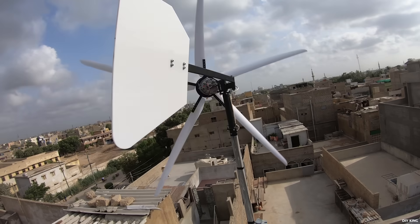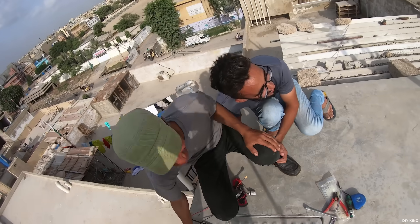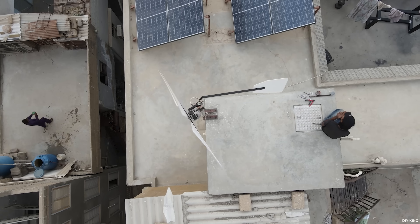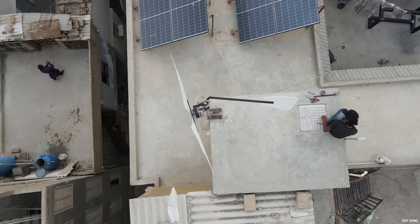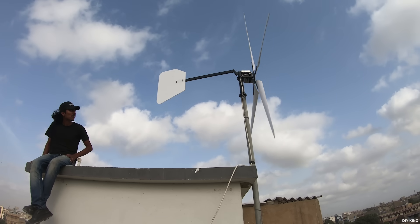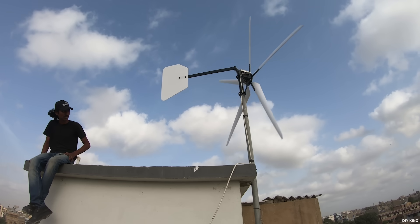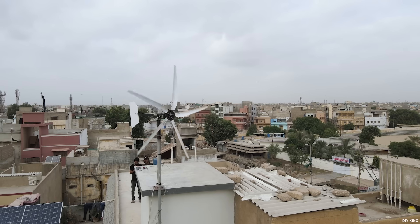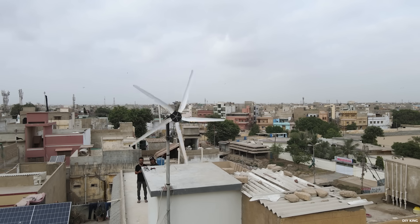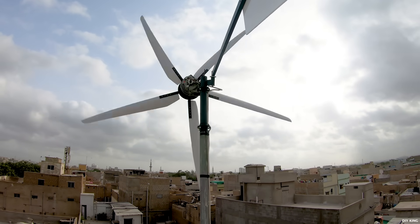Well, if you are listening to this, we did manage to save our asses. The wind was blowing quite a lot and if you have noticed, the tail started whirling towards the left. This happens when the blade achieves momentum as the turbine reaches threshold speed, which can be lowered by decreasing the size of the tail and its weight, and vice versa. This prevents the turbine from over-speeding as the blades are not following the wind direction anymore. Aside from having this much wind, we were unable to get the required RPM.